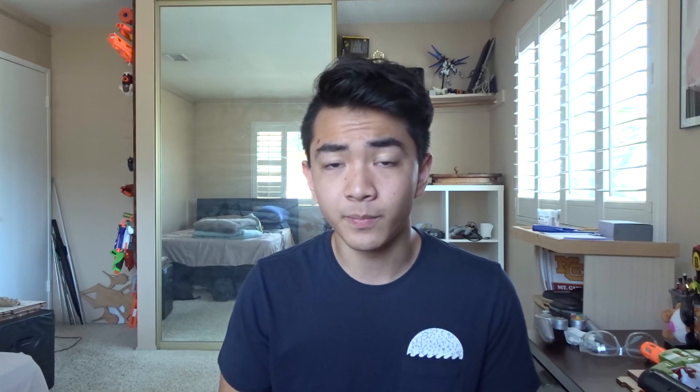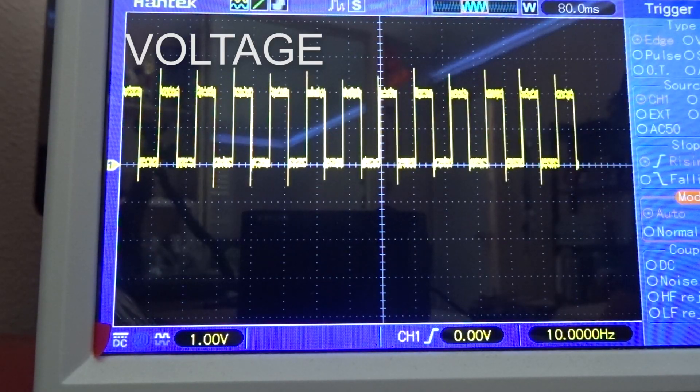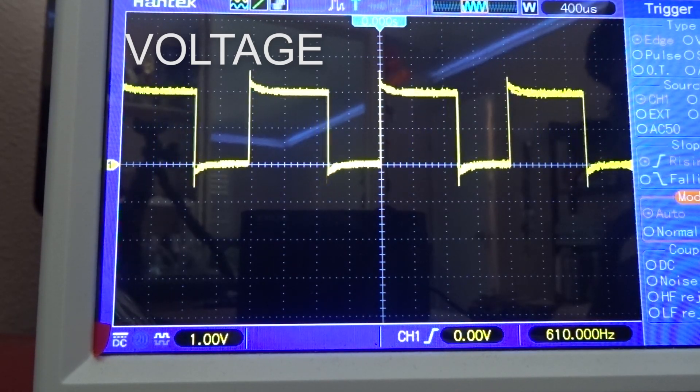Having all our goals lined up, it's time to get to work. Upgrading the motors is going to be the easiest part — you're pretty much just buying better motors and then a battery that can handle the jump in current. Slowing it down isn't too bad either. Rather than limiting the voltage or current with something like a resistor, we're going to be using what's called PWM. You can think of PWM as effectively turning something on and off, but very precisely and very, very quickly.